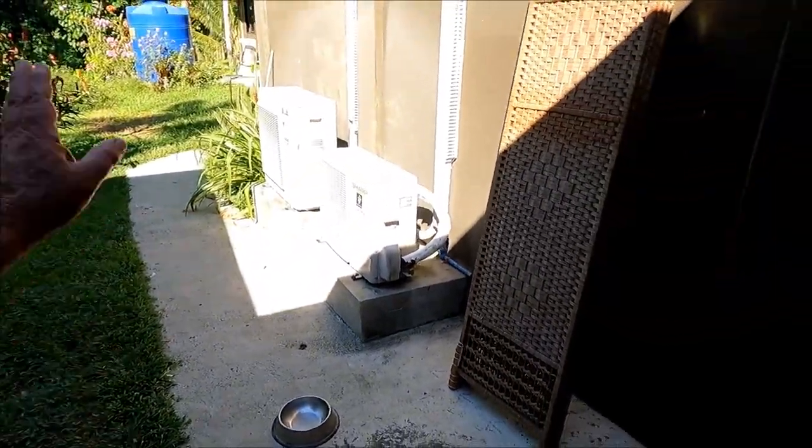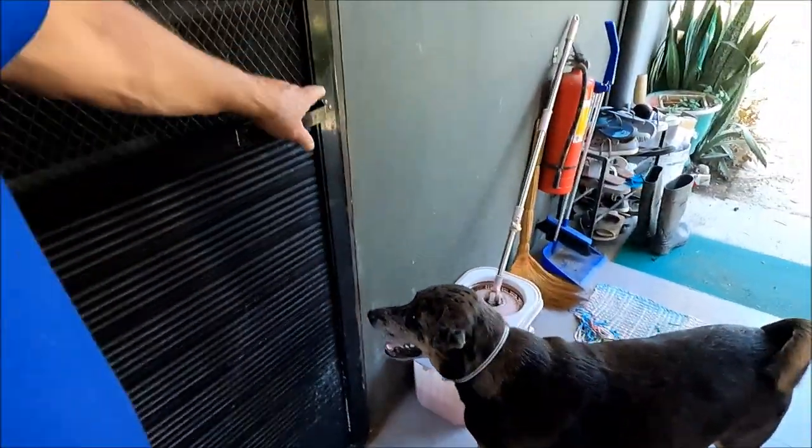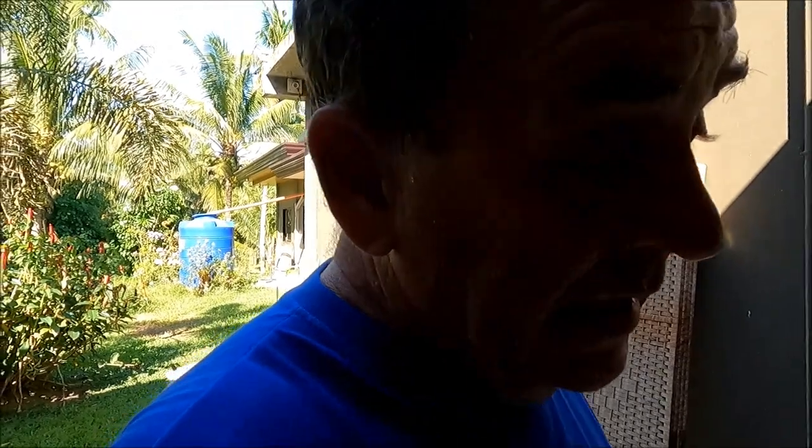When they did the plumbing to this house they used all half-inch pipe — and because the half-inch internal diameter turned into one-eighth, having a shower was like standing underneath a budgie going to the toilet. So every tap had an on/off valve outside, and I cut the whole lot off and turned it all into three-quarter inch.